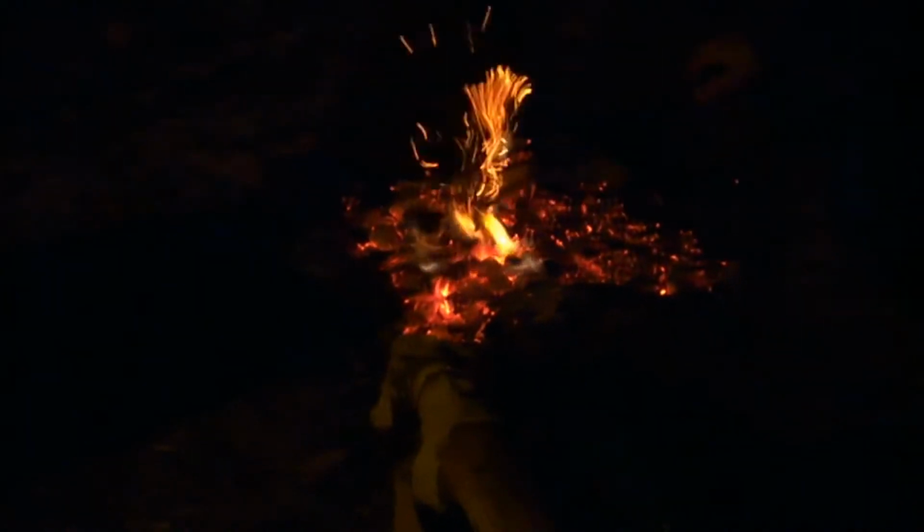Why are we doing this at night time? Because we need to see the color changes on the blade. If you do it in the daytime, you cannot see the color changes, so you cannot guess the temperature. Also, the whole blade surface must be the same color. If the color changes, it can bend. To get the blade homogeneous like that, the temperature must be homogeneous. That's not homogeneous.